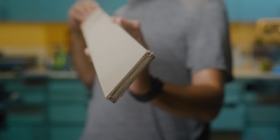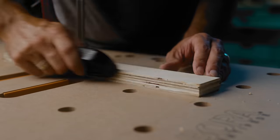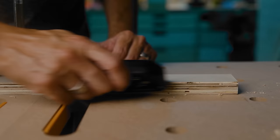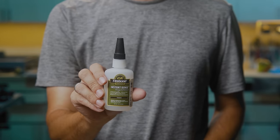There's no need for one of those lasers that really doesn't even work. It's tempting to overcomplicate this — you can use a nice half inch piece of hardwood and buy hardware to attach it from the back, and perhaps you should. But you don't have to. If you have a scrap piece of half inch plywood or half inch MDF, you can rip that down to the height of your fence. Just make sure you plane or rout a chamfer on the bottom edge to provide an escape for sawdust. You can also cut a shallow rabbet on your table saw, or shim up the auxiliary fence using some playing cards while you fasten it. Securing it with hardware is best, but in a pinch you can use the blue painter's tape and superglue activator trick.